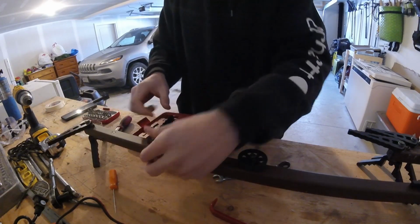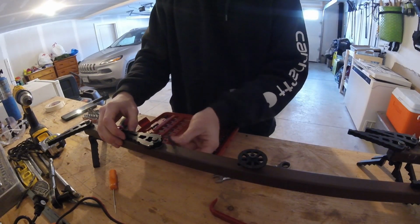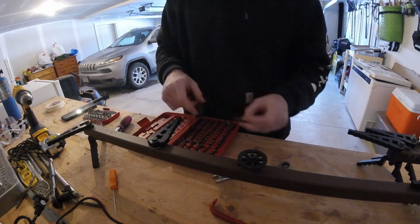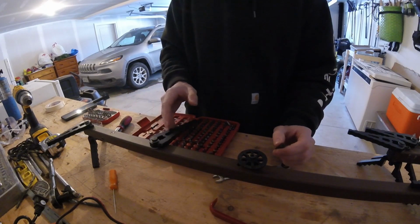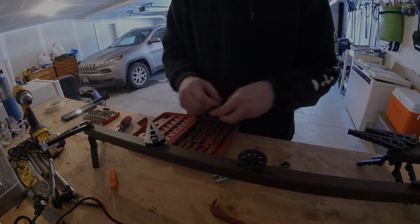Now, the reason why we're blowing that other hole through here at 3/4 inch on center away is because this step still needs that head to stop. When you come out, it needs that pin in the center to stop that step. So that step will be the top step. Altogether, this mod's going to involve one cut, some filing, a 1/4 inch hole. Other than that, some shuffling of some hardware, and then you can dip it as you please.